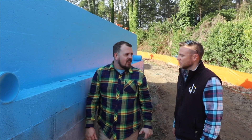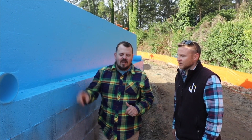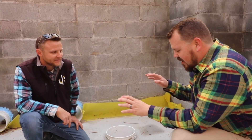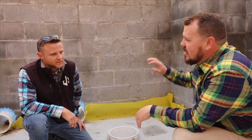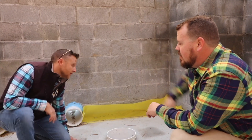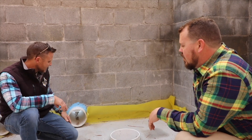The water management on this is incredible. Let's step inside the crawl space. This is the back side of one of those CMU walls, and this wall will have insulation — we're going to have two-inch Thermax foil-face insulation going on here.